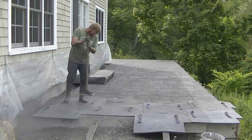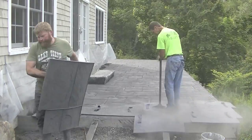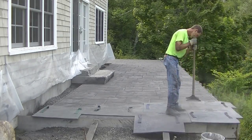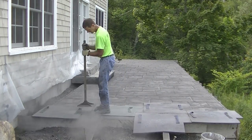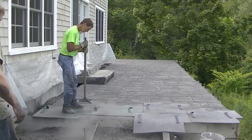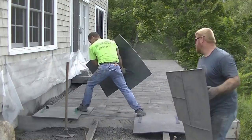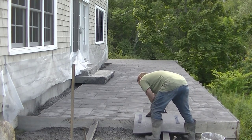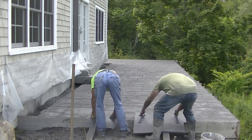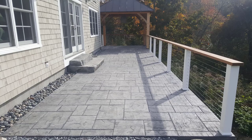That stamp concrete course will teach you how to do all of this — it's down in the description below. This is what it looks like after we get done: once we finish stamping, we come back the next day to wash and saw cut it, then let it dry for 24 hours, and come back to put the concrete sealer on. It's usually: form it up one day, pour it the next, then clean it, saw it, and seal it — so it's usually four days for us to do a project like this.